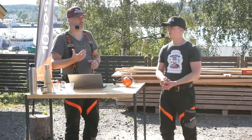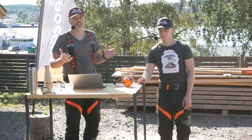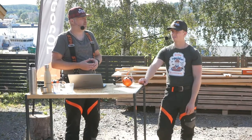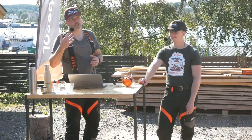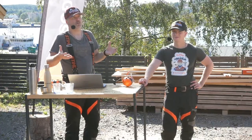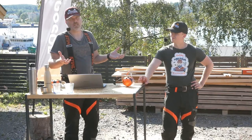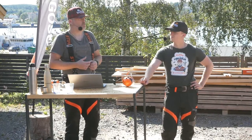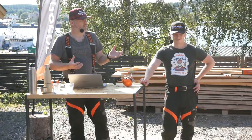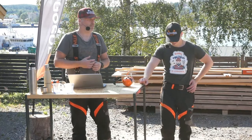Above that, we offer the Big Mill solution, which can handle logs up to 80 inches in diameter. It's still a chainsaw mill solution with double-ended guide bars and a big chainsaw. But instead of looking at the band saw mills we have, the B751 or the B1001, where you can handle larger logs at a higher capacity compared to the Big Mill, the Big Mill is for slabbing really huge logs, which you can't do with a chainsaw mill like the F2 or F2 Plus.